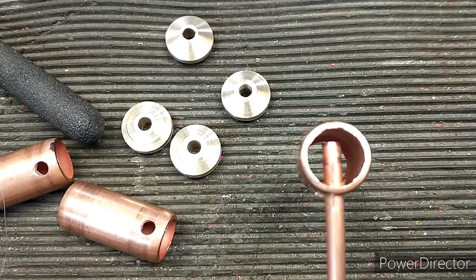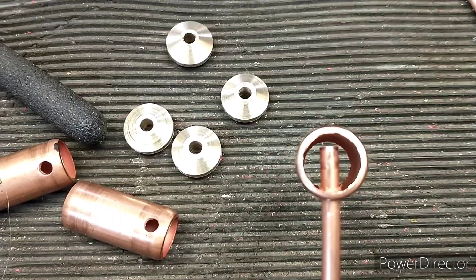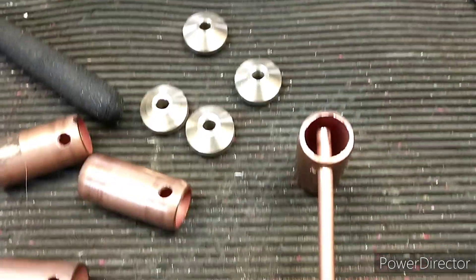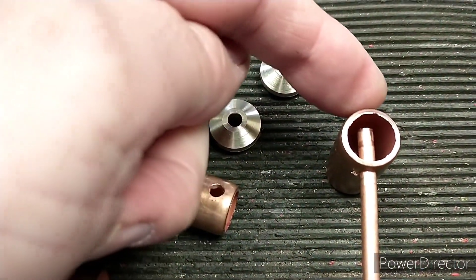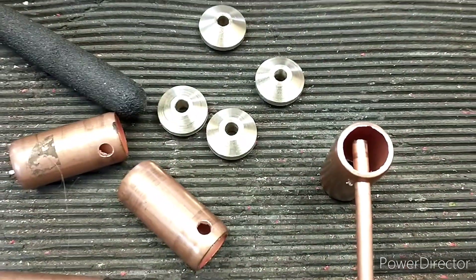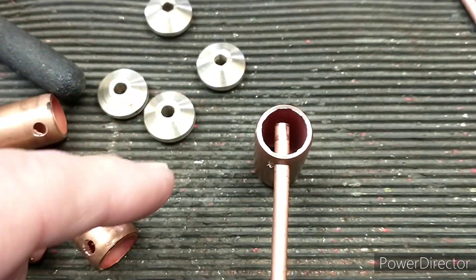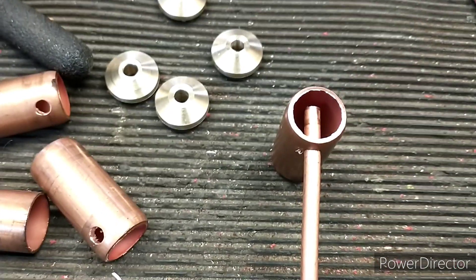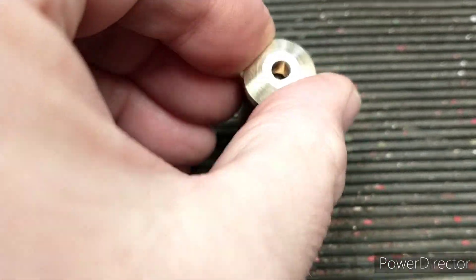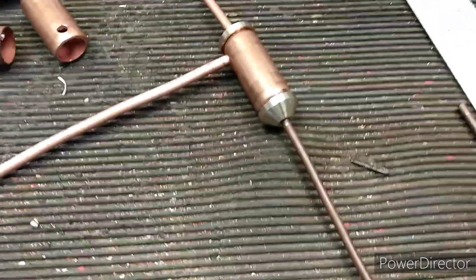All the 15mm pipe is cross drilled. I'll set up this pipe as an example to show roughly what the position is. You want a gap equivalent to the internal diameter of the pipe at the far wall, so that the oily steam will really hit this side wall quite hard. That causes any liquid to impinge on the side, stick, and drop down, while any steam rises upwards.